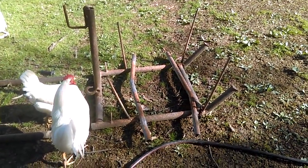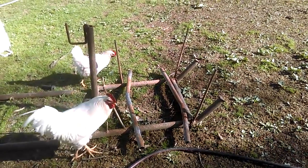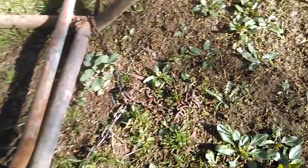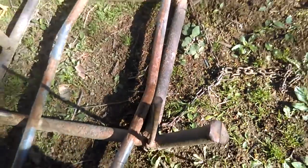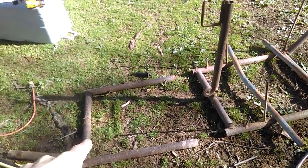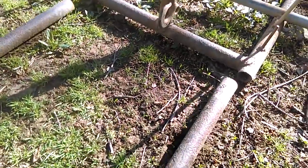What you're looking at here is the part of the water sled that holds the 100-gallon stock tank. You see those upright arms - the stock tank sits between those and those arms keep it from falling off when I drag it to the next paddocks. There's a little piece of log chain here in the front that I hook up to my ball on my ATV and that's what I drag it with. The part I need to update is the calves need something to drink out of that the cattle cannot access. My game plan is to take this piece here that's already welded together, slide it over to this, and weld them together to make them all one piece.